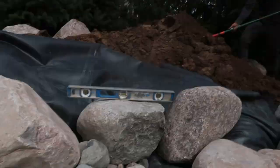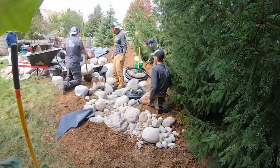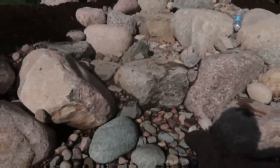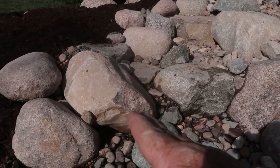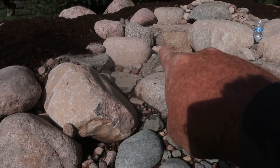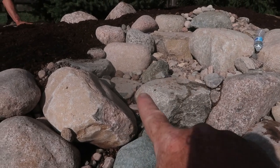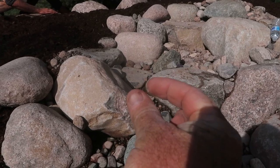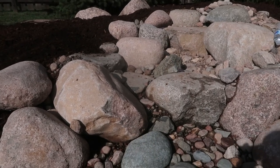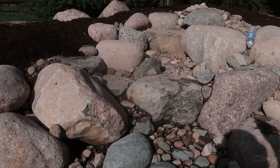When I laid that rock down, it opened up a huge gap. Because I have a big enough pump — a 2-5 — I'm going to embrace this and let water actually drop from back here, drop back into here, and then come around and split over this rock, while still having water come over the other side. A lot of times it's easier to just push rocks close, but then all you get is a single waterfall. If it looks good dry, it's going to look better wet.